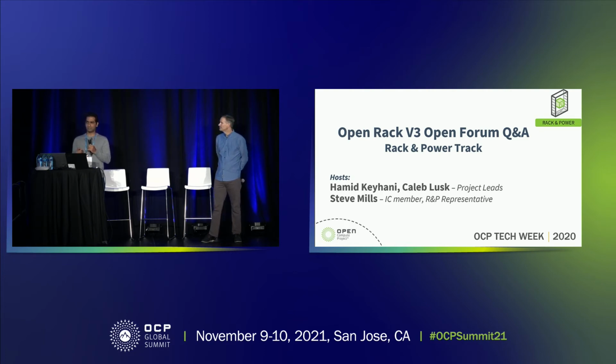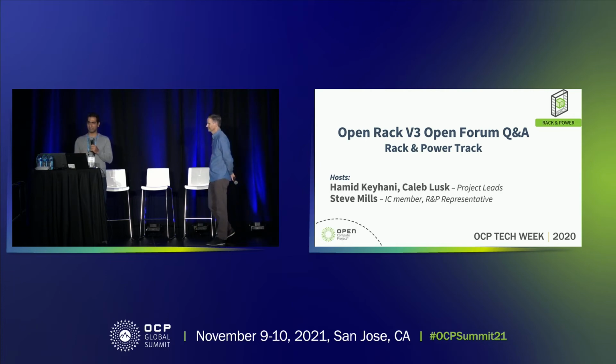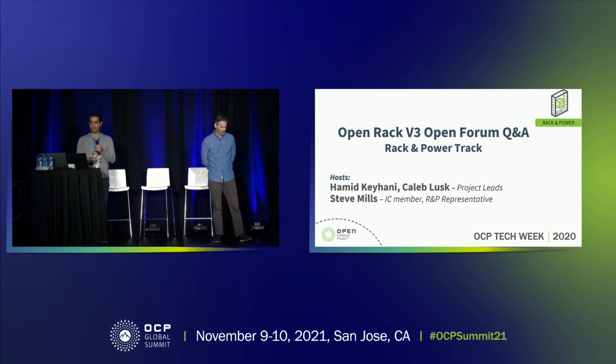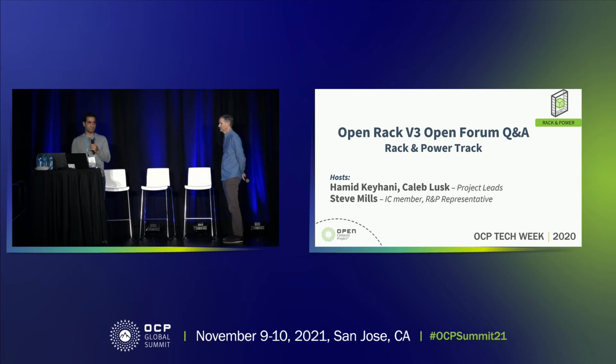I believe the specific Modbus spec is complete, which is through PMI. I believe you're asking about the PMC, the communication through Ethernet. Correct. So that one through Modbus, the specs are complete, the register maps and all the details are out. The communication piece overall is the piece where you will find different customers do it different ways. Someone likes PMBus, some like Modbus, someone likes Ethernet. So we saw that we cannot enforce one solution for everybody, and that was the reason we made the communication piece modular, so you can move it out and put in another one with any other type of communication that you like.